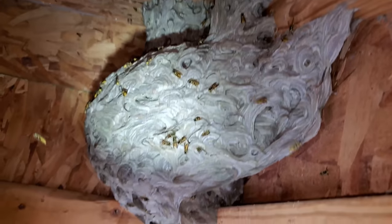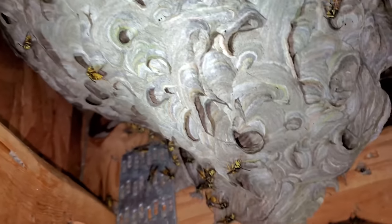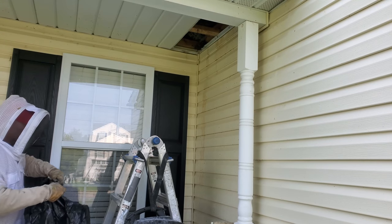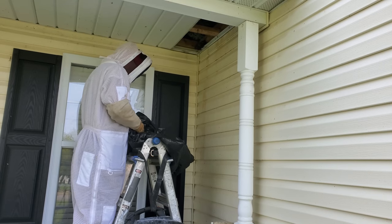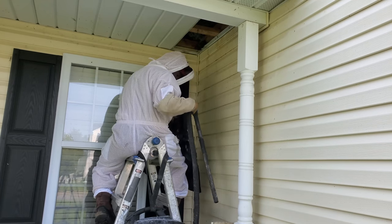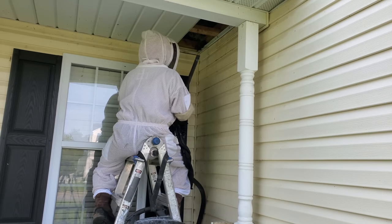Unfortunately, a lot of houses around here are built that way. There's not a lot of sealing on the exterior structure, so anytime there's vinyl soffit or siding — even aluminum siding or soffit — there's a lot of corrugation, perforations, and very loose joints between these plastic or aluminum materials, which allows insects to get in. People think their houses are sealed tight, but they're actually not. A lot of them are meant to breathe, especially perforated soffit going into an attic space, which always allows cavity nest-building species like yellowjackets to get in and start their colonies.